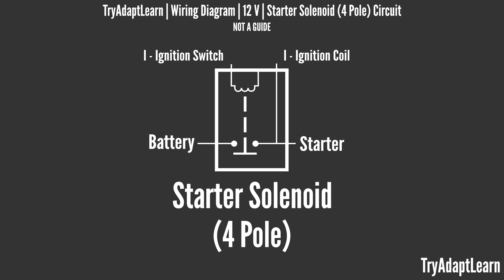How it does it is because the solenoid inside the assembly will create its own magnetic field that will pull a momentary switch to close the circuit. When the switch is open, the solenoid will lose its magnetism and the momentary switch will then open as well.